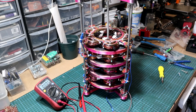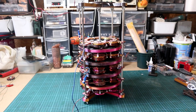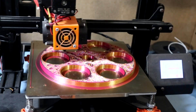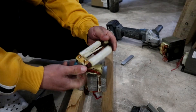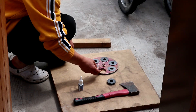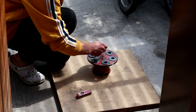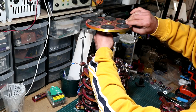This generator works on the same principle as a wind turbine. I think I can improve it further because I still see some headroom, so I reprinted another stator support and another rotor. I got more microwave oven transformers, cut them with the grinder, and salvaged the primary coils. I wound more coils for another stator — this time also 12 coils, six on each side. I populated the magnetic rotor with the last magnets, secured them with super glue, left it to settle outside, installed the stator with coils, did all the wiring, and then installed the magnetic rotor on the frame.